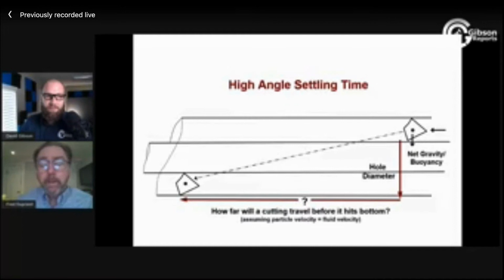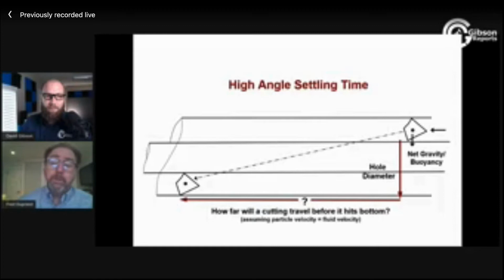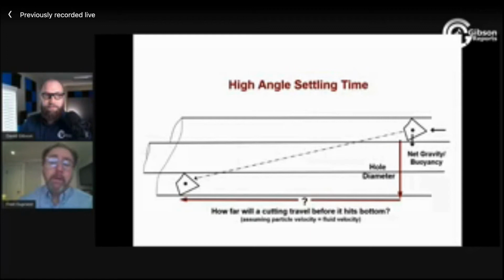I can actually go to managed pressure drilling and add 2 pounds per gallon of stability mud weight, or maybe a pound and a half per gallon. And that's going to stabilize almost any situation. If it was survivable to begin with, it's going to be probably about perfect once I do that. So if I say my limiter is hole cleaning, I do nothing. I probably reduce my flow rate to avoid losing returns. And that's certainly not what we want to do. But if I say my limiter is lost returns, I might be able to find some solutions.